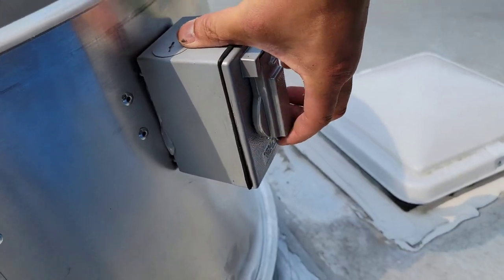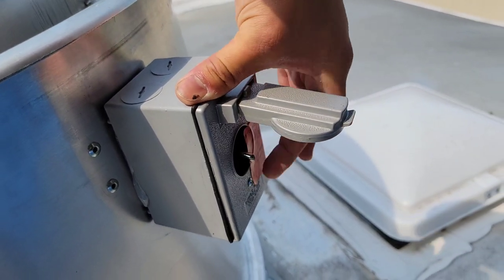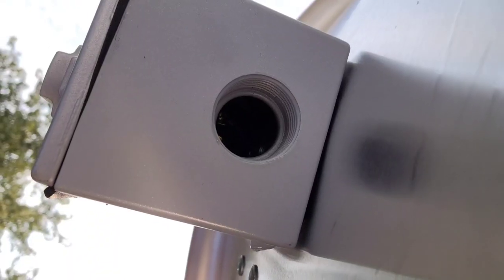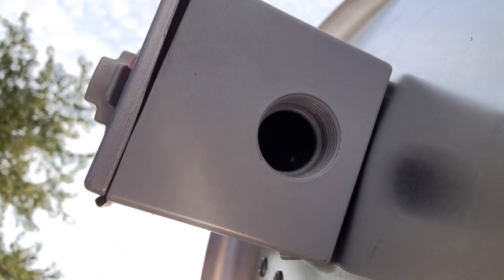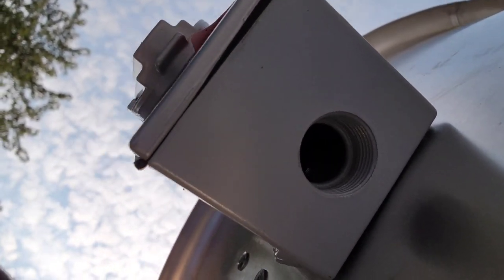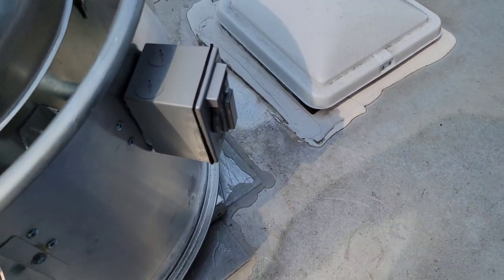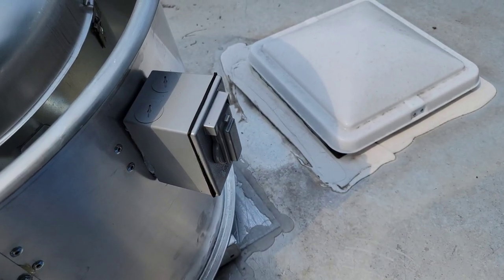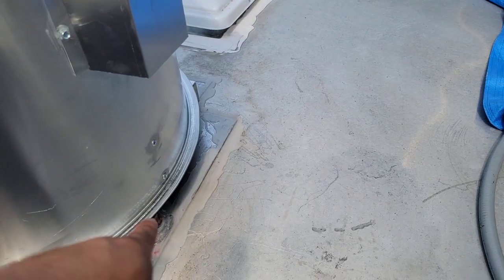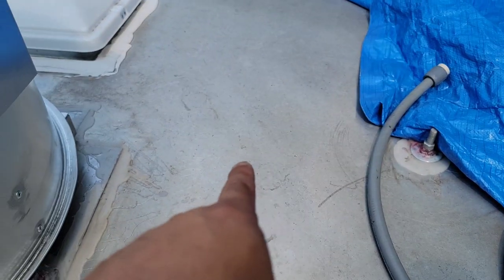And this is that box that I'm telling you about. It's a switch that controls the exhaust fan. We're gonna take this cover off, and then underneath here, that is looking at the bottom of the box. That's where that liquid tight connector would go. As you can see, that's a 3/4 inch opening. Just wanted to give you the visual on there so you can see it. But that's the switch box or the disconnect that you have up here on the exhaust hood motor. And between this stud right here where this bolt is and this one is where our exhaust Romex is.